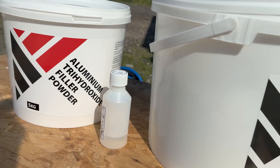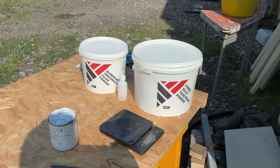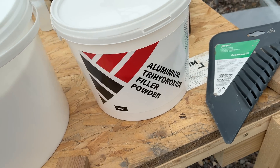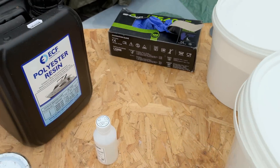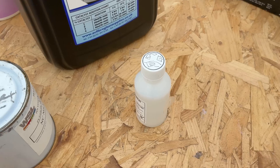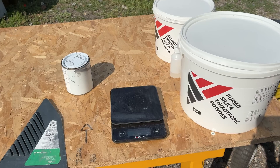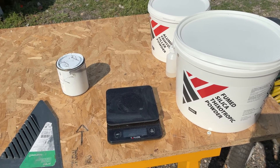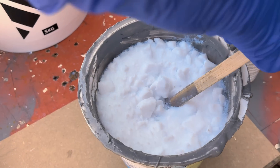Now for large pots of special powders used to fill out and change the properties of resins. Aluminium trihydroxide — because one hydroxide is never enough — and fumed silica. Today we're using polyester resin and the MEKP catalyst you need to add to kick-start all those juicy polymerisation reactions. To make a strong filler with this out-of-date resin I don't want to waste, we add the two powders and some grey pigment so the resin isn't clear and we can see where we've been.